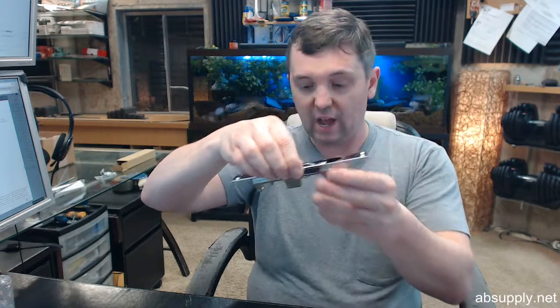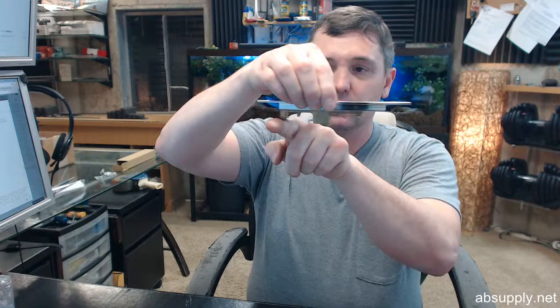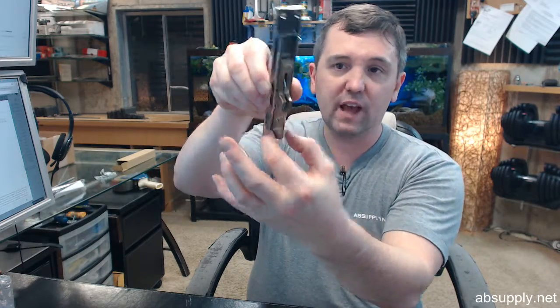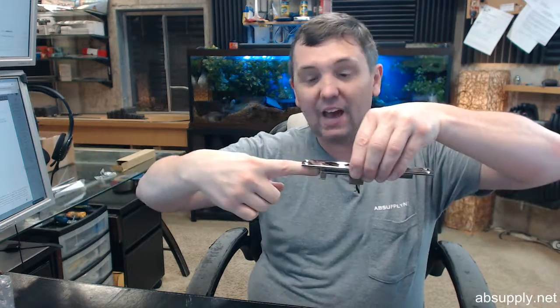Again, mortising for the material is not difficult really at all. Just to touch on it, you'll have really 3 preps. You're going to have the body, which will be the body that's all down here, this width, this length, this depth. Then you're going to have your plate, which will be the thickness of the plate, the width, and the height. But the key is you have to drill a hole from the bottom or top of the door down into the cavity that you've drilled.